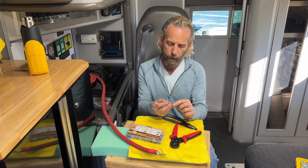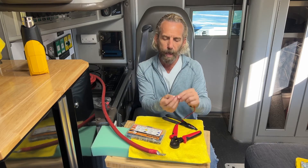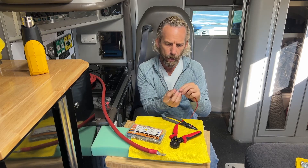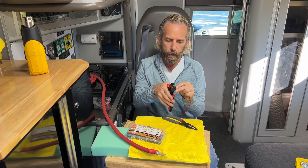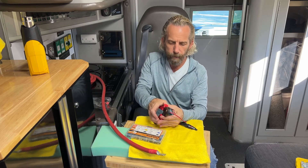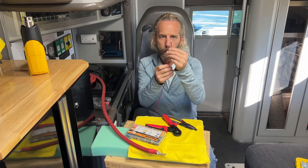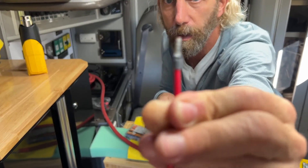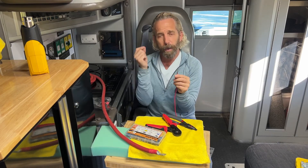The kits are really easy to use and I highly recommend having them, along with the larger heat shrink kit that has sizes from one-eighth up to one inch — you just do the cross-reference for your wire size. Put the wire into the ferrule like this; you know it's gone far enough because it stops — it's like a little connector. I stripped it to almost exactly the length of the ferrule. Then put it in the smaller crimping tool and crimp.